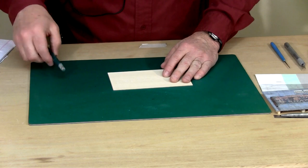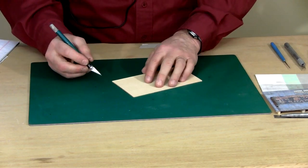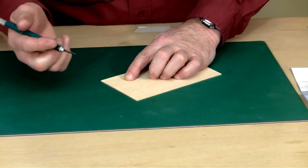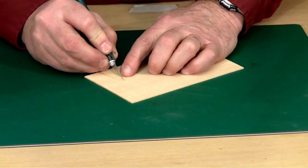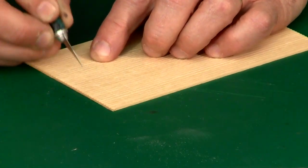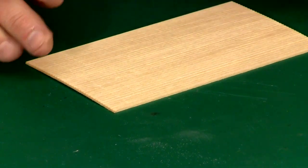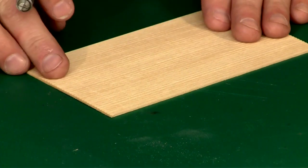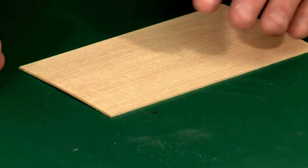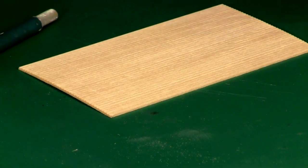The next step we're going to do in our distressing of the wood is we're going to end some ends of boards. And the boards would have ended on one of your studs on your wall, and that's where your nail holes would be. And just by taking a sharp knife and cutting just one of the boards in random patterns around, you're looking for the long runs on the board, under the windows, above the windows. Usually when a window breaks it up, they use the full sheet. But just scribe them in, and later on when we weather it, those are going to jump right out.